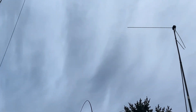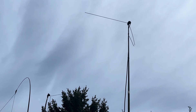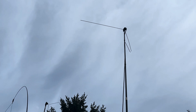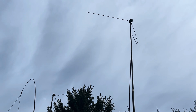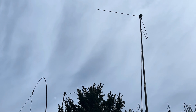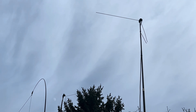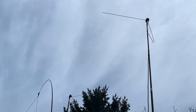Some of you will know that I've been doing that myself but using a horizontal V-dipole. I've got two already set up. The wind has blown the nearest one around about 90 degrees and I haven't done anything about that, because I haven't actually been recording weather satellite data from my QTH now for several weeks because of the terrible noise I get on 137 megahertz. So they're basically there — I've got two SDR Play receivers connected to them, the RSP-DUO and the RSP-DX, but because of the noise it's very hit and miss as to whether I receive any telemetry at all, sometimes nothing.